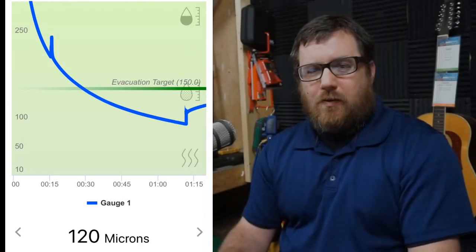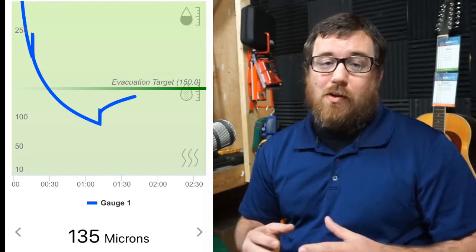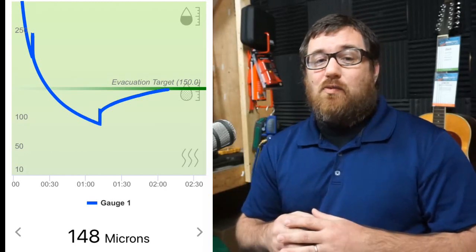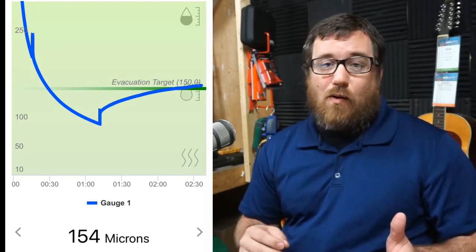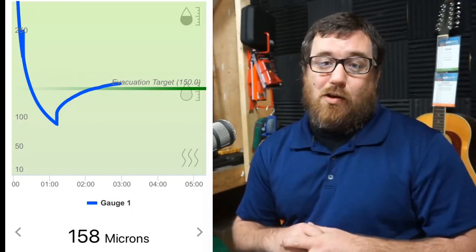It was really interesting to see how the line curved more than I thought it would. And what's even more interesting is the rate of leakage. We're going to look at the scale and talk a little bit at the end. Here's the deal — this whole test is at high speed; I've accelerated this thing a lot, multiple times, but it's extremely fast. This whole leak test portion lasted two hours, and we're going to fit it into about a minute clip. I want you to realize how slowly this thing is leaking. We're going to give you an exact number based on the last hour of the leak test — putting one point at an hour back and one point at the very finish — and calculate how many microns per minute this thing leaked. I have some bonus information at the end that's going to blow your damn socks off.